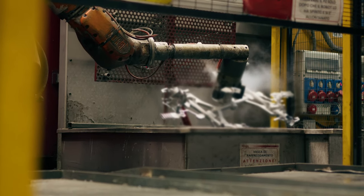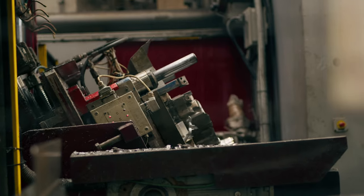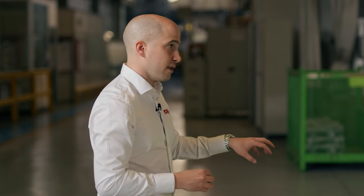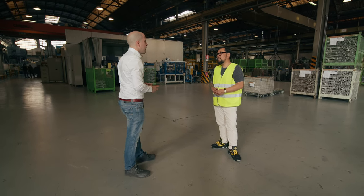After the quench, if pieces are compliant, they are taken by the robot arm directly to the trimming tool. This is another difference from gravity die casting, where the cut was performed manually in another department — here the cut is done right beside the machine by the trimming tool. Then the robot takes the pieces from the trimming tool and gives them to the operator, who performs a visual check with a magnifying glass. We also have an automatic control machine that checks whether the inner channel is empty, using a laser sensor. Pieces are then separated by die and cavity, since in high pressure we often have multiple cavities in the same die.